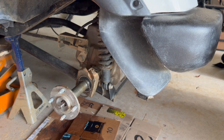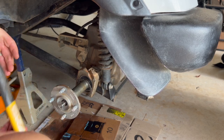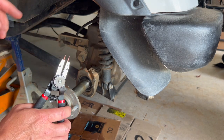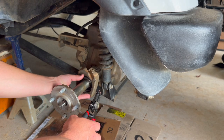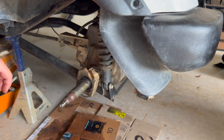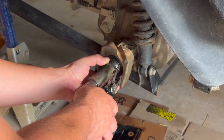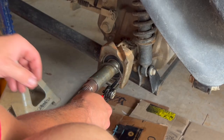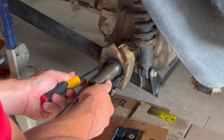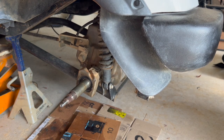If you need to, you can tap on it to get it to go in. I can now see the groove where this ring goes in. You need pliers with the correct attachments for split rings to get that in. This would be easier without this piece on, so I may pull that back off. With that out of the way, it's easier to access in here. I'm going to put my tips through the split ring, clip it down all the way and try to work it back in, use a screwdriver to push it in here, and it snaps right into place. That should hold everything in nice and firm.